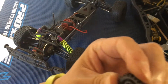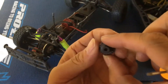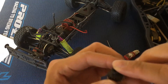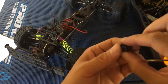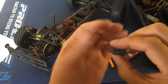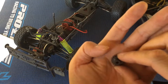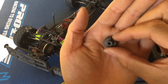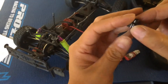Let me see if I can find the number of teeth on this pinion — sometimes they're embossed. You'll see an engraving, but this one actually doesn't say, so I'm going to have to count the teeth. I won't bore you guys by doing that on camera, so let me pause and count. Alright, this is an 18 tooth pinion. I start with my fingernail on the first tooth to the right of the set screw and go my way around — 18 teeth.